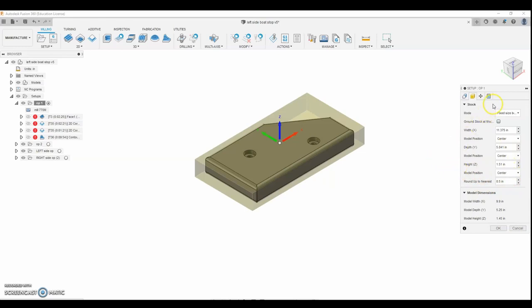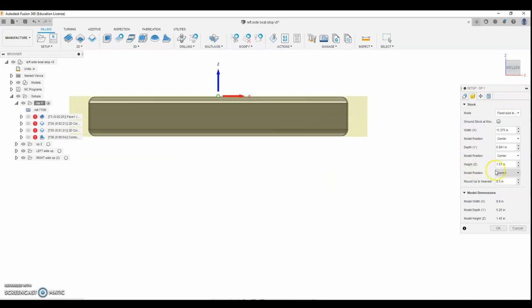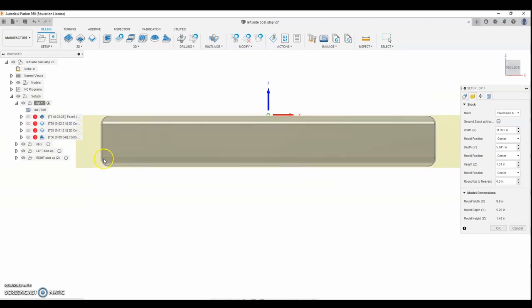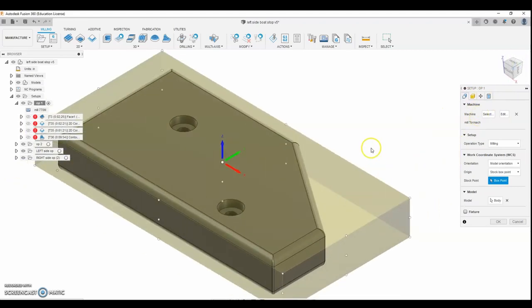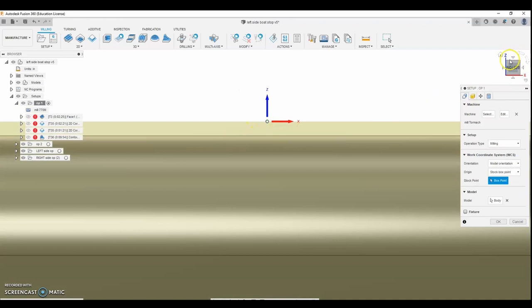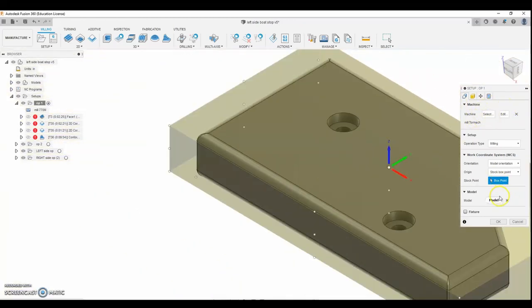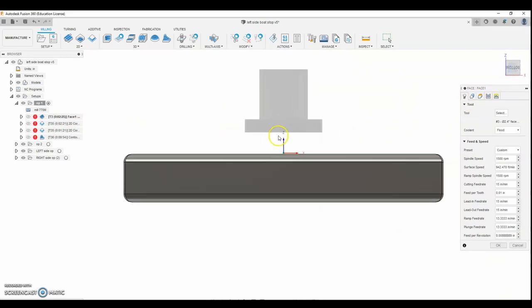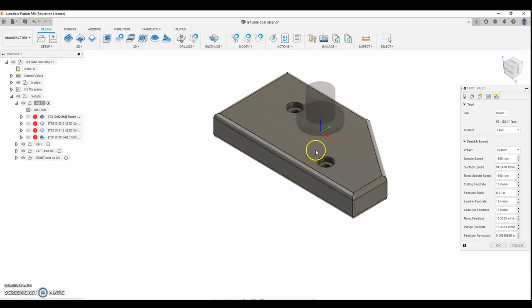The stock dimensions are rough estimates of what I could measure since the block was milled. I put it centered in the block so I didn't have extra material to hold onto — I only machined so far down, then flipped it and cut the top off. After setting up the stock, I went to Box Point, selected the center of my stock and the top as my Z. A problem I ran into was machine travel: the block is 11 and 3/4 inches and I have a two-inch face mill, which basically maxes out my travel if the block isn't perfectly centered.